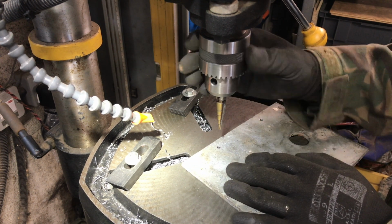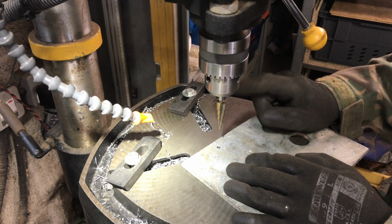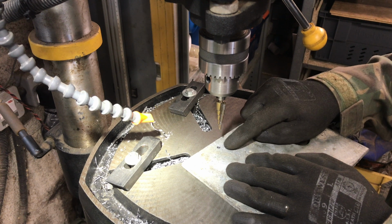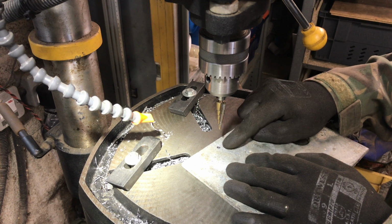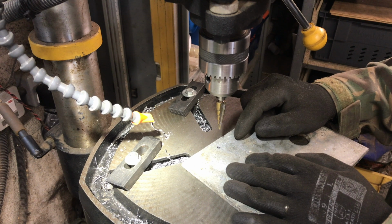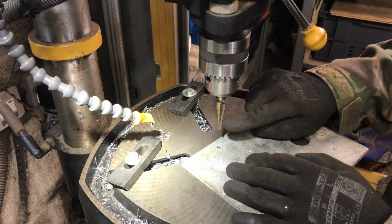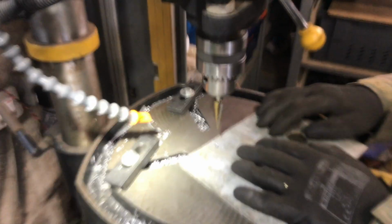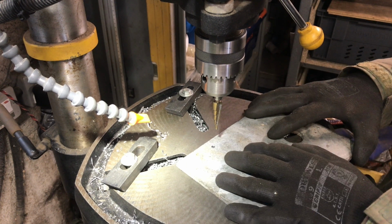Well, I want to talk about these drills. I don't know if you've ever used these. They're step drills, really good. Now I want to drill this hole out to about 6 to 8mm. So I'd probably start it off with a centre punch, 2mm drill pilot hole, then go up maybe 4mm, 6mm, 8mm. But here you've got 4mm, 6mm, 8mm, 10mm, 12mm, all in one shot. And there's no wobbling around as you change the drills when the new drill starts biting the new hole.